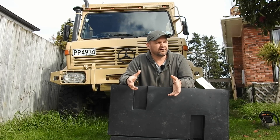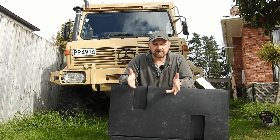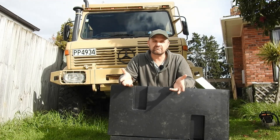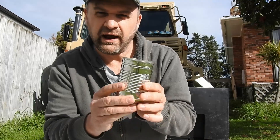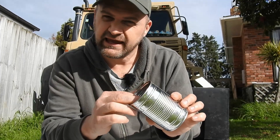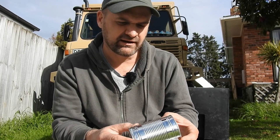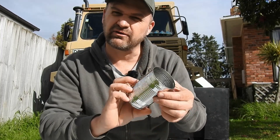So what we'll do in this video: I'll show you roughly how rotational molding works, we'll cut the tank open, figure out what went wrong, and I'll show you what I've done instead. I'm going to use this can as an analog for a mold. In rotational molding, they fill the mold up with a plastic powder — in most cases polyethylene powder — then close it up, put it in an oven, and spin it around at all different angles.